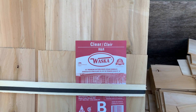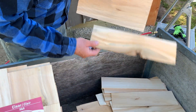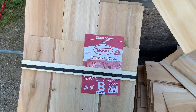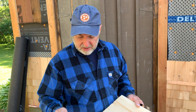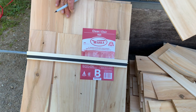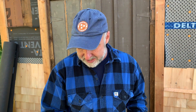Clear in this case means no knots or defects — that's what clear means in the wood department. But you can see there are some knots and defects here. That has to do with the grade B rating. It's clear in the five inches of area that you would leave exposed. On your place, Robert, we used grade A clear, which means the whole shingle is clear with never any knots. For wall use, grade B is fine, especially on an older building. The grade A is nice, but it's not necessary for walls. A bundle like this covers 25 square feet with the five-inch exposure and cost me $41 Canadian at the mill. Grade A would be about $60-something dollars for the same size bundle, so there's a cost savings.